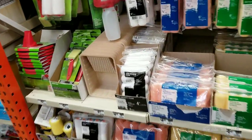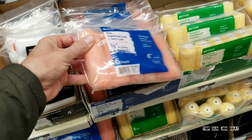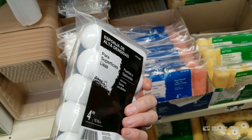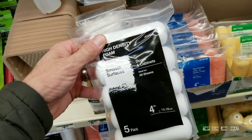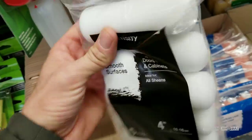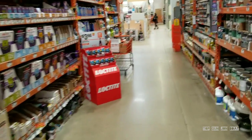When I say zippy roller with that oil-based paint, I'm talking about a high or medium density foam roller. This is what I use — it gives you a really smooth coat. I stay away from nap rollers with my oil-based paint; I always use a foam roller. For two-by-two framing or plywood, it really gives me a good coat. These are high density, ideal for all sheens — for doors and cabinets. Buyer beware: once you use these with oil-based paint, you won't be able to clean them out. What I do is wrap one in a plastic bag and just keep reusing it without letting it dry out.